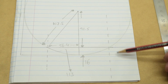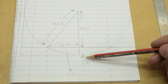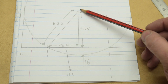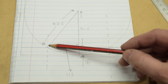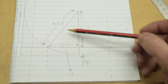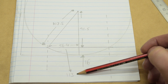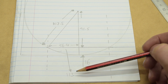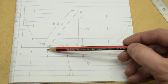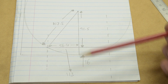This motor has to sit down through the bottom of the foot of that angle, and that foot is about 15 odd thick — so if we call it 16 we're erring on the side of caution. The end of the motor plate is 215 diameter, so this forms a little triangle. If we knock the 16 off the radius we get this number, and using Pythagoras we can work out this side of the triangle. If we double that and round it up, making a cut that's 113 wide should give us clearance on this corner for the motor plate, leaving plenty of material for the bracket to be bolted down to the frame of the bandsaw.